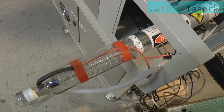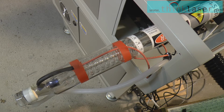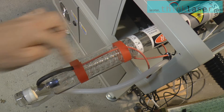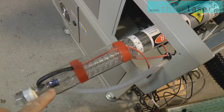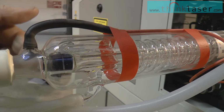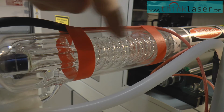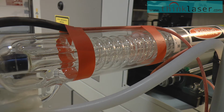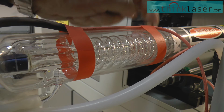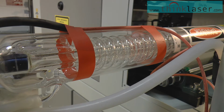Okay, now down at this end of the tube we've got this red cable, very thick red cable, which is capable of taking, I think, about 40,000 volts, but it's a 25,000 volt cable, this one. And this cable goes to that blue electrode there, which is the anode. But when this tube is working, the gas tends to flow towards this positive electrode. It returns and comes back. Can you see that pipe there that's going across the top? You can see the spiral tube here. Now that basically is spinning the gas round, and then it deposits it just underneath this label here. The gas is spinning around at that point in time, and it travels back along the reservoir to the other end of the tube. So there's always a circulating flow of gas through this tube.